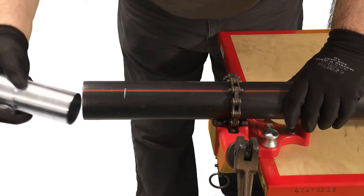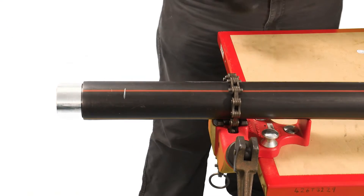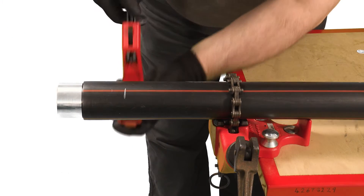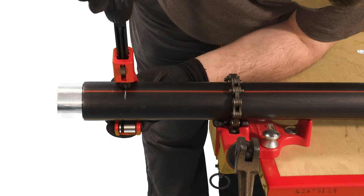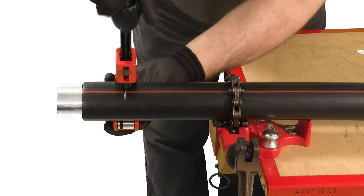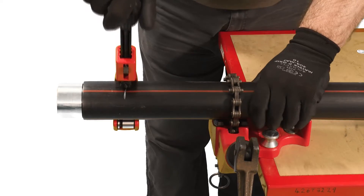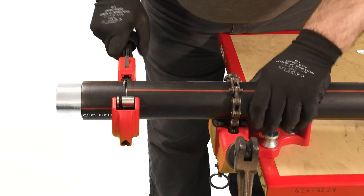It's important to make sure the pipe is cut clean and square, so a wheel cutter is best suited for this job. The use of a wheel cutter ensures a square cut and swarf-free pipe. Insert the pipe protection sleeve into the interstitial space between the secondary pipe and the primary pipe, cut the secondary pipe, then mark the primary pipe to the socket depth plus an additional 10mm.